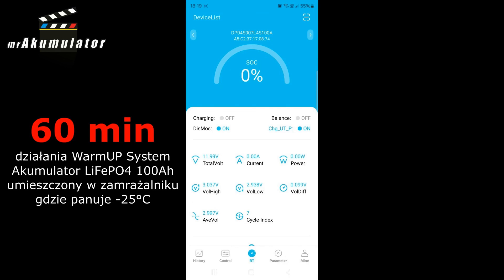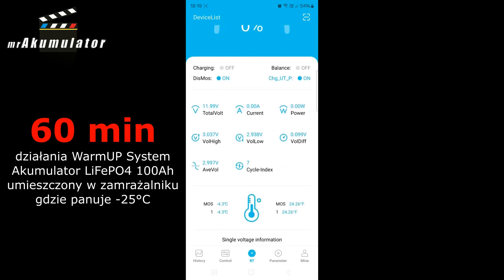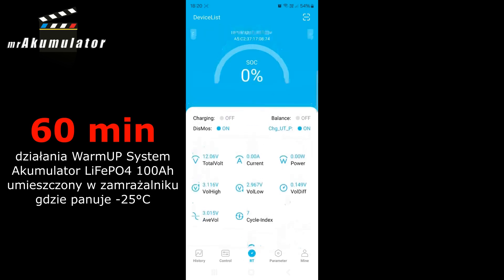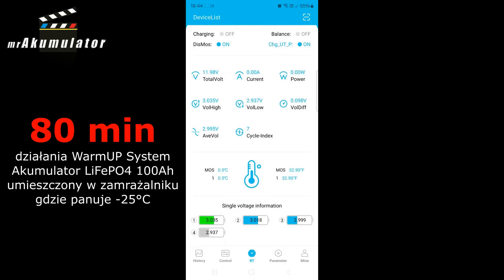We are approaching the hour since the charger has been connected to the LiFePO4 battery located in the battery storage. Look — the temperature is minus 4.3 degrees Celsius. An hour in, and we raised it over 15 degrees. We are waiting for the moment when the charging begins. After approximately 1 hour and 25 minutes, we already have a 0.5 degrees Celsius increase on the cells which the temperature sensor is recording. It is already 0.6 degrees Celsius above zero. Now we are waiting for the moment when the charging option will switch, so that we know exactly at what temperature.